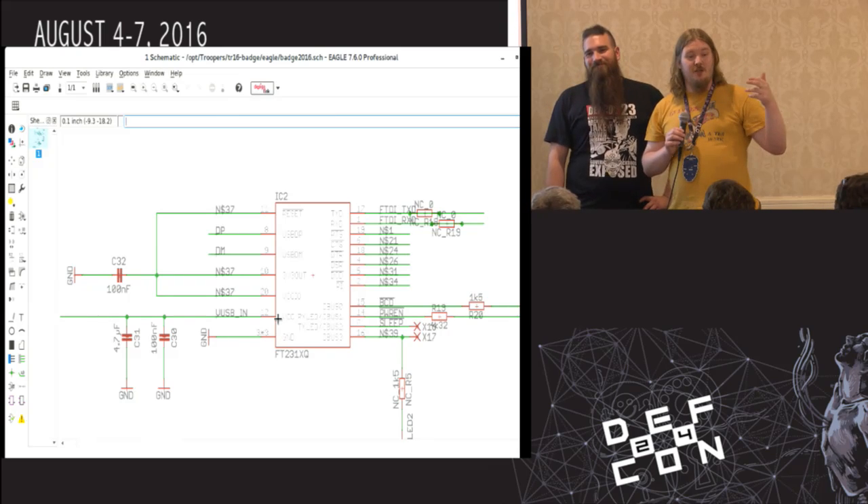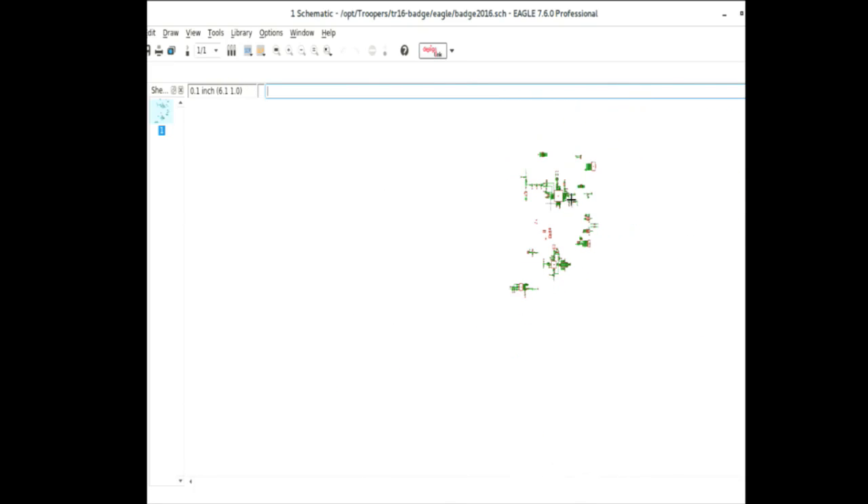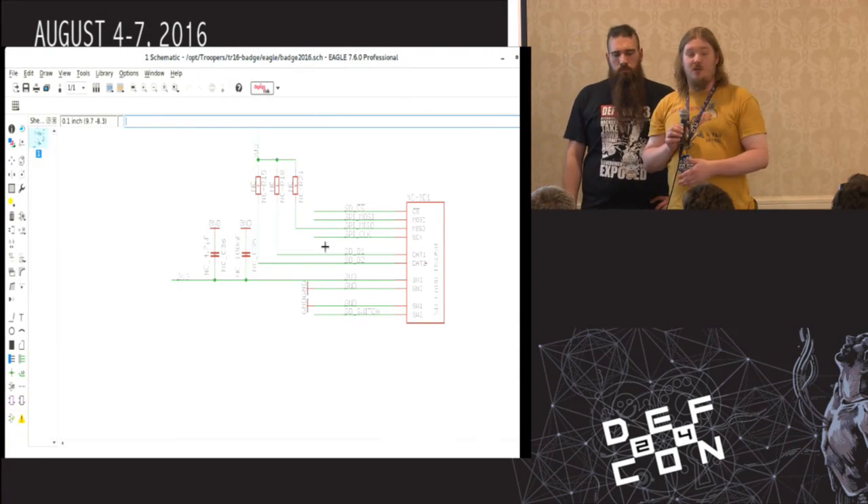The CC1310 can be flashed via serial, so it's got a serial bootloader. If you actually look through the data sheet you'll see that absolutely all peripheral pins can be mapped to every other output pin, the way it is with modern SoCs. The only thing that you can't remap are the two serial pins for the bootloader, and that's actually in the data sheet somewhere on page 700 and a bit. We've got an expansion header at the bottom, just if you want something to play around with.